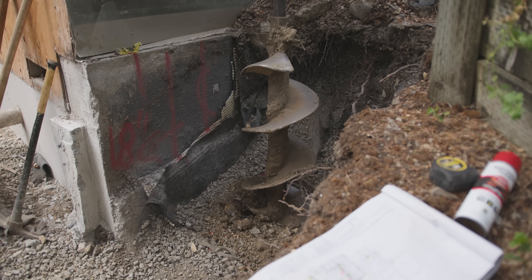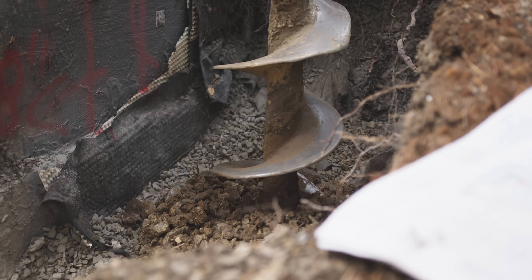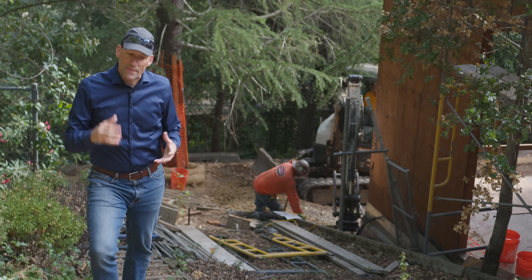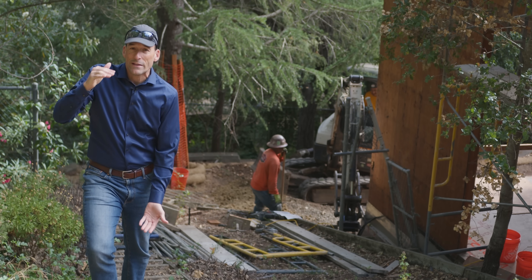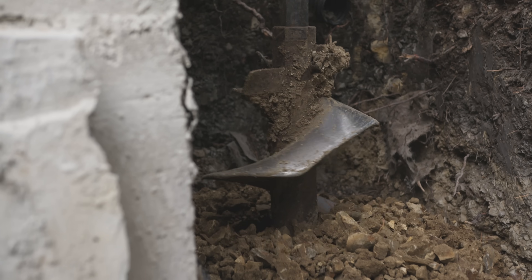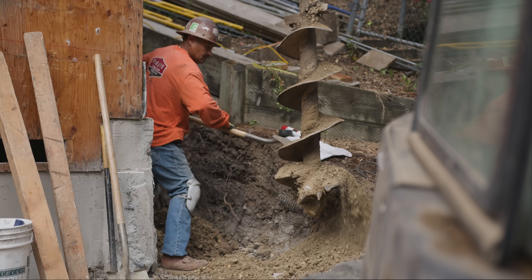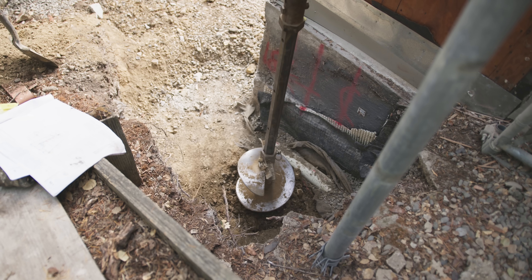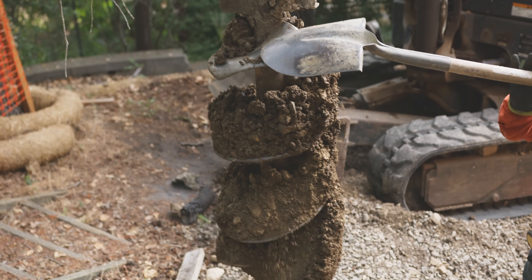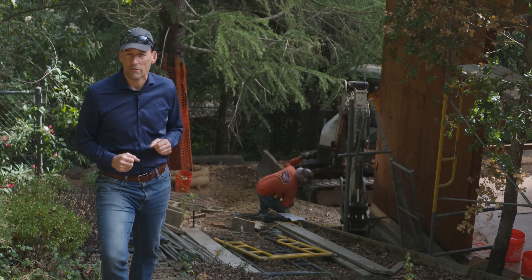They're drilling holes behind me with a giant auger. You see about a six or eight foot tall auger with about six feet on top of that, but that pier actually has to go about twice that deep. As you can see in the overlay video, they have to go in and out of that hole and pull all that dirt out over and over again until they get the pier deep enough to hit solid rock, ensuring the house won't move and the new load on the foundation will sit on a solid foundation.